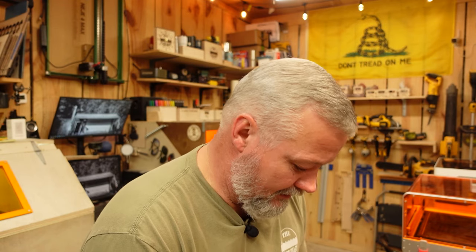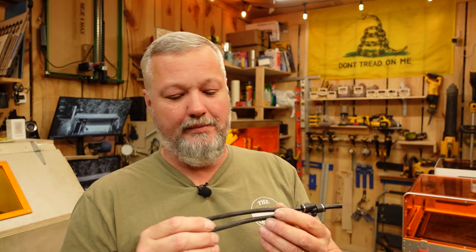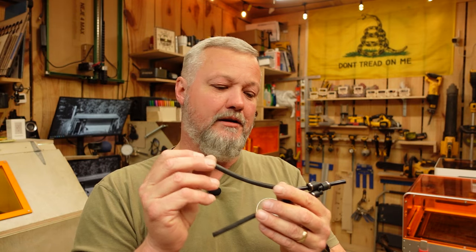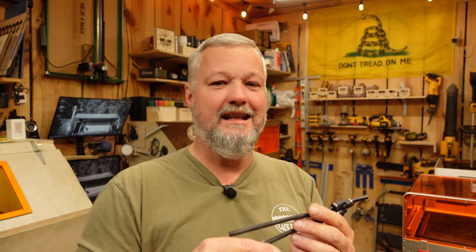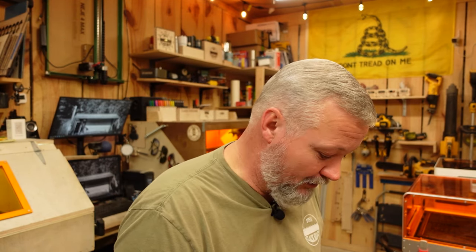If you don't have a machine controlled by LightBurn, you can add manual switches — this is a switch that plugs in line with the air pump. A lot of air pumps now come with adjustable knobs and switches. In this video I'm mainly covering the automatic air assist setup. You can also make a T-connector for a two-stage setup: a small pump on low all the time, and shop air through the relay for high power. After the relay I always put another water separator — water will destroy your lens, no question.